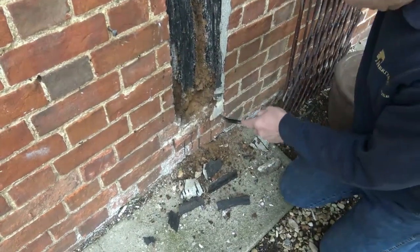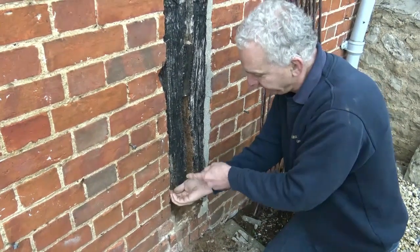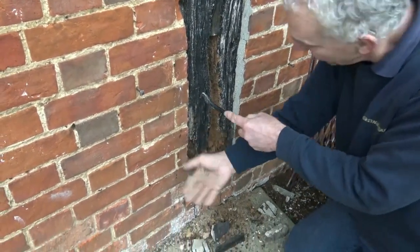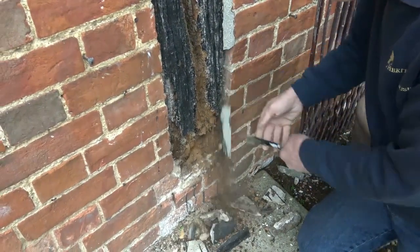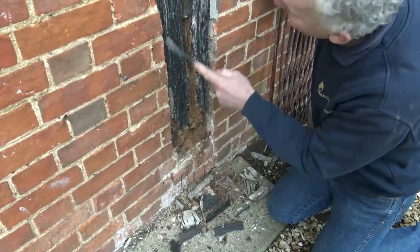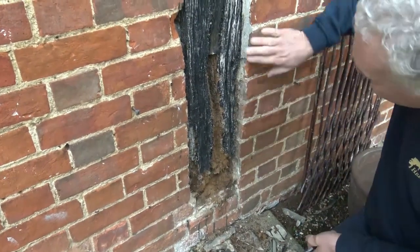What people have done over the years, where the brick infill actually comes up to the timber — it's here, all alongside it. This is all lime, so you've not got a problem with deterioration of the timber. Where you've got more deterioration is here, where some idiot has replaced it with cement. This little bit here actually isn't too bad, but on the side here we've got loads of rotting of the timber because of the cement.